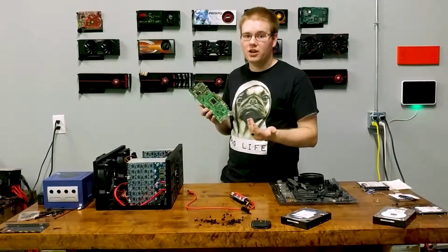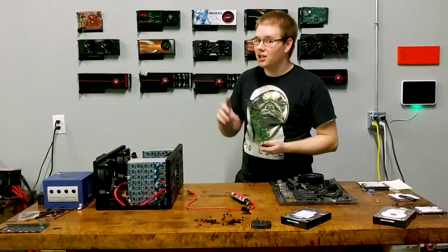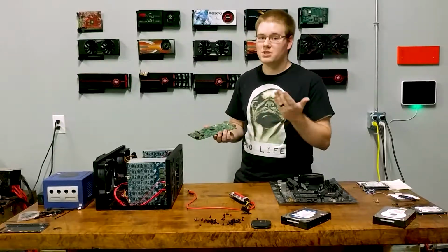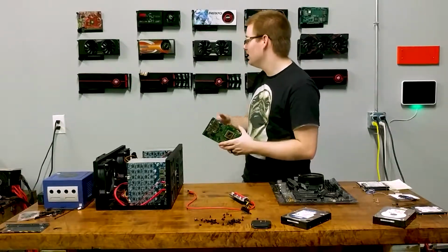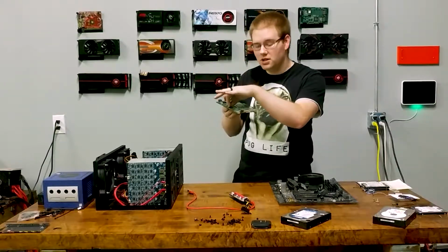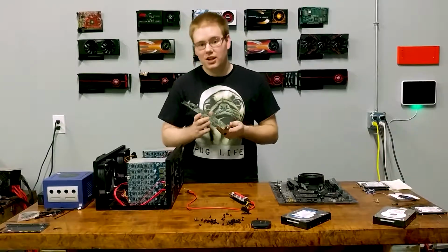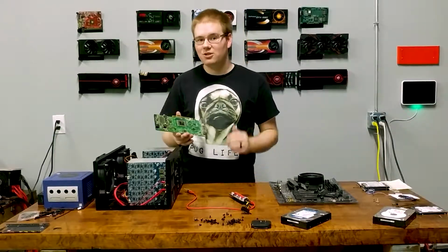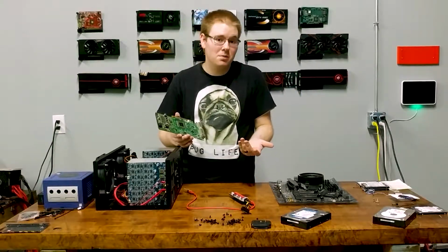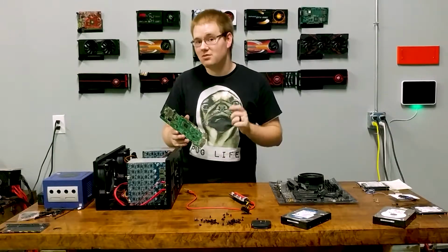And that's why baking a GPU in your oven is supposed to help revive it. If that GPU was used for gaming and went through a lot of hot and cold from starting and stopping gaming sessions, then a lot of those joints will have worn out, and in theory, melting those joints and getting them to rebond will revive the card. But with mining, generally you set it to hot, and it mines 24/7, and it stays one temperature. So that is one thing you basically do not have to worry about from a used mining card.